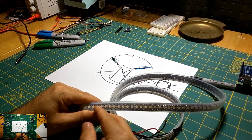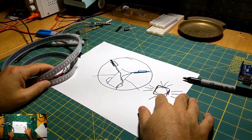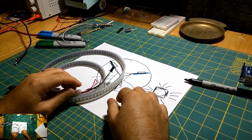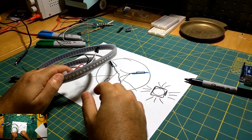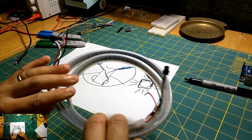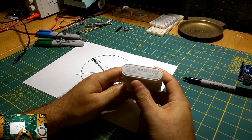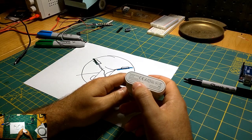I would say you could run, in this configuration, you would have basically 8 if you ran both sides on all sides of the crossbars. You could run them off of a little USB battery pack for hours and hours. I would say for like 12 hours you could run it. Again, this is a complete estimate, but this is what I've been testing with here, which is a 10,000 milliamp hour battery. I haven't tested. It's saying it can drive 2.4 amps.